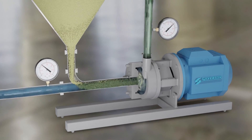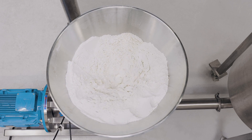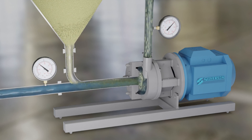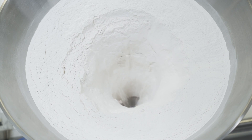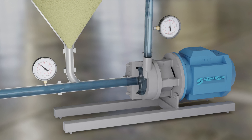If the flow rate of the liquid is not sufficient, the powder liquid mixer will not be able to absorb the powder at the required rate, and there is a limit to the percentage of powder that can be added in a single pass. If the percentage of powder being added is too low, the powder liquid mixer can potentially incorporate air, and most importantly, if there is even a momentary bridging of powder in the powder hopper, then liquid will pass through the mixer without any powder being added.